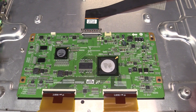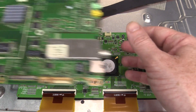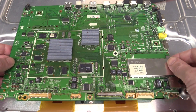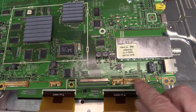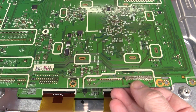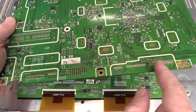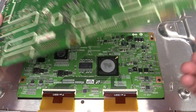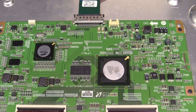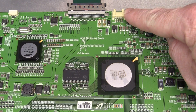So why was there no damage to this T-Con board at all? Even though it's got a very similar looking connector, this one just melted all of these connectors right along the edge. If you'll notice, these are actually through-hole connectors on the bottom - every single one, there's four of them - and they all melted on this board. Whereas the T-Con board survived just fine. The connector on the T-Con board is not a through-hole connector; it's actually a surface-mount connector.